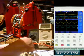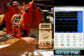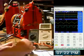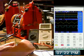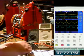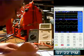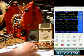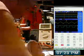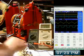So if I put this pull down resistor between gate and MT2, we should definitely see something happening. If I can see which hole to stick it into. It's so difficult getting them holes. Oh, that's the top pin there. Alright, so I want to pull it out now.